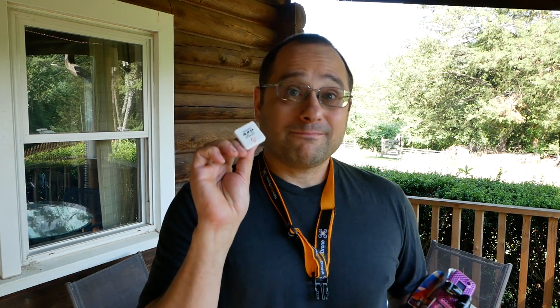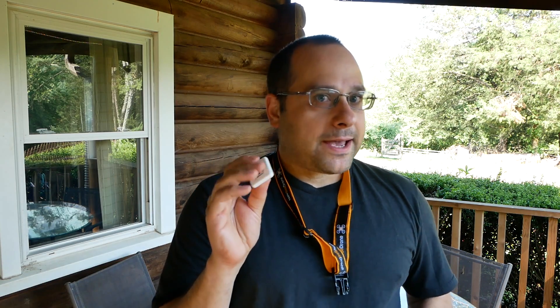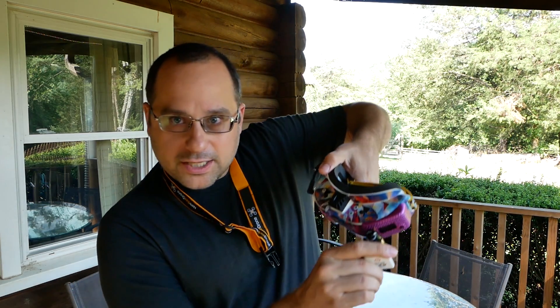But why would you not just use a patch? The truth is that an omni and a patch will usually give you better coverage, as long as you know that at least some of the time you're going to be flying in the direction the patch is aimed. If you've got an obstacle like a barn you need to punch through, or you're flying at a bando standing outside aiming in, a patch is going to be helpful. But a patch gives you less consistent coverage — if you drop your head, the patch is aimed at the ground, the omni antenna is at its weakest spot, and you're done.